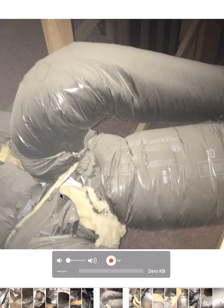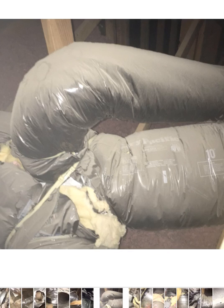Obviously a lot going on here — this is a big mess. Improper strapping, just a big jumbled mess, no mastic. So when I see this, I usually know there's probably going to be some air loss here. And sure enough, I start pulling things back — you see the discolored insulation, so I know there are air leaks in this area. See the zip tie, no mastic — air leaks.